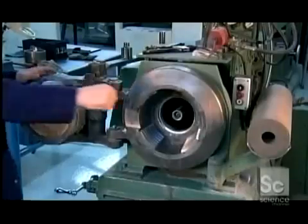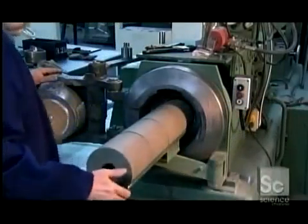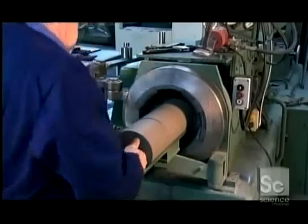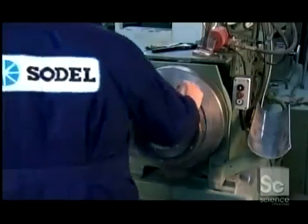Now to put the powder coating on the core wires. A worker loads 4 slugs into an extrusion press. It'll apply 120 tons of pressure on the slugs to shoot the powder through nozzles that'll coat the wires as they pass through the slug's hole.